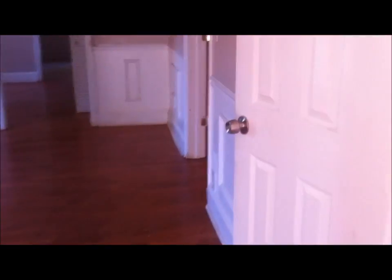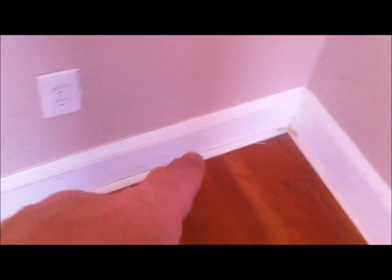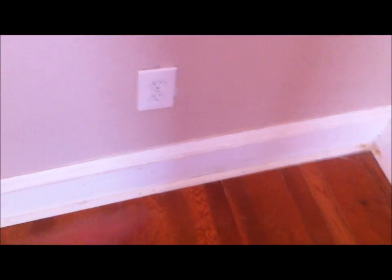I'm on the floor above the crawl space right now, and this is the area where all those posts were removed. You can see the floor has settled down here — this is the real visual indicator: this humongous crack over the corner. This floor has really gone down. They covered the gap when the floors deflected by replacing that quarter-round molding at the bottom of the base molding, which was put in at a later time to cover the gap that appeared.